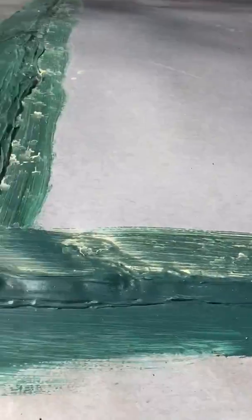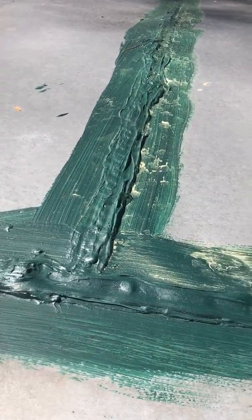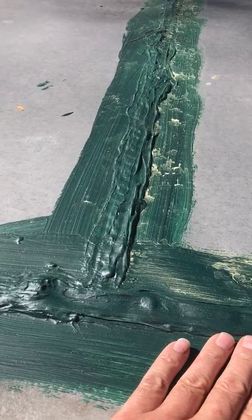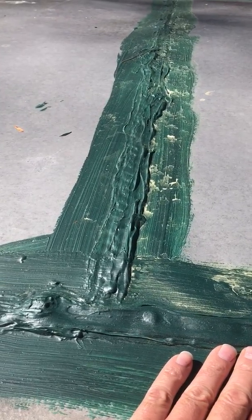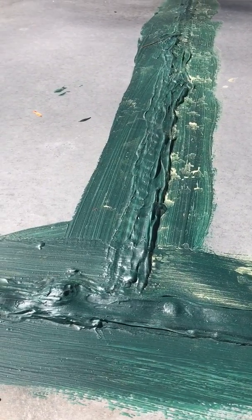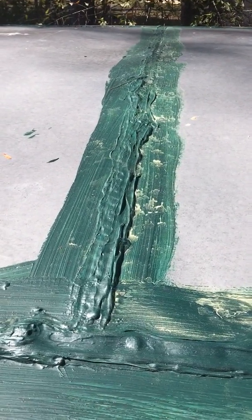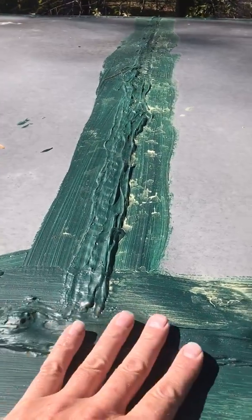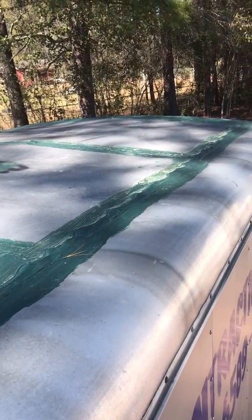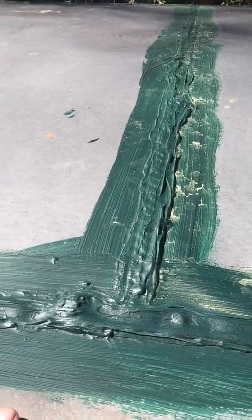So, I'm a general contractor, and I was just recently doing a masonry shower, and I use this. It looks green when it comes out of the can. It's blue. It's a rubberized waterproof membrane. It's for sealing showers and backer board, and everything that's going to be underneath tile in a shower or a bathtub, anything that's going to have standing water or constant exposure to water. This waterproofs it. So I was thinking, maybe I can just waterproof the top with that. And I did that. I'm down here in South Carolina, and we've had some torrential rains for the past week or so.